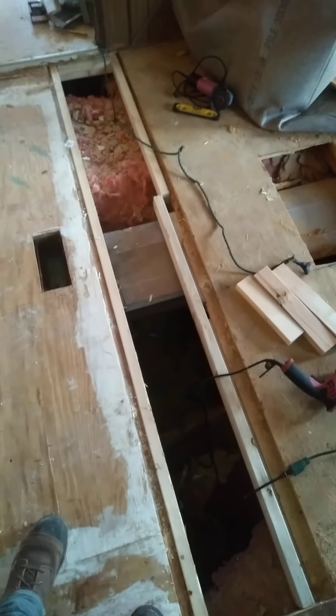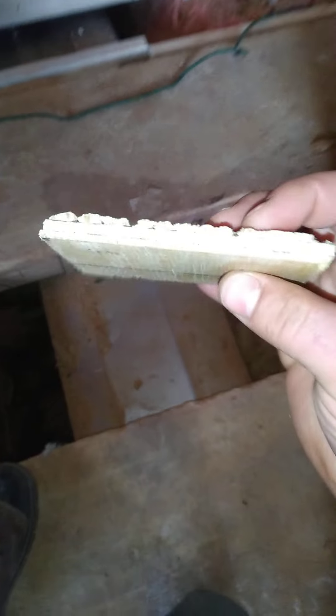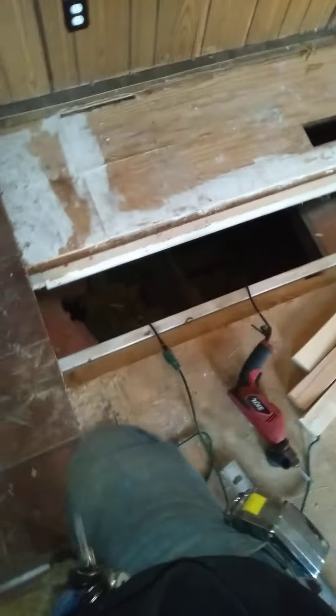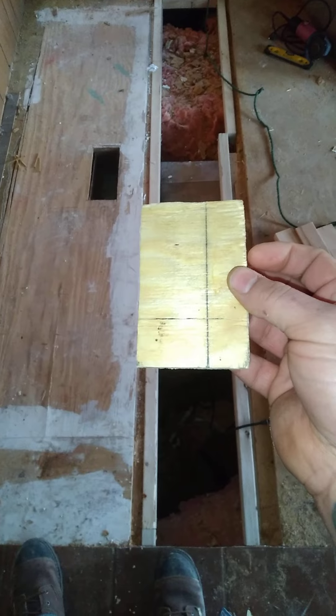What we're doing today — we had to tear out several weak spots in this floor. The plywood that our client wants us to lay is a lot thinner than this MDF board. This MDF right here is about an inch thick total, and this plywood right here is three-eighths. What I wanted to show y'all today is how you can get smaller plywood to butt up with existing plywood that's thicker.